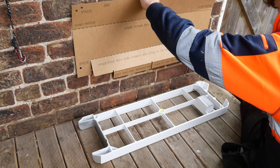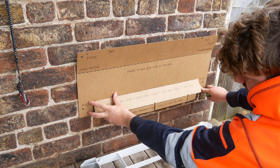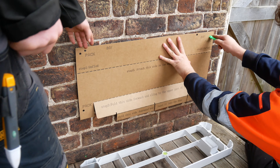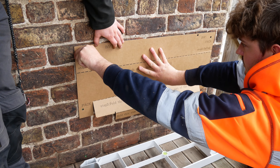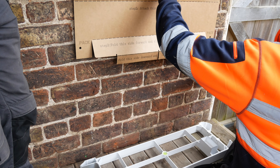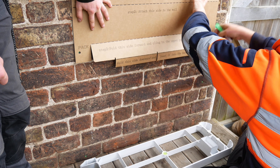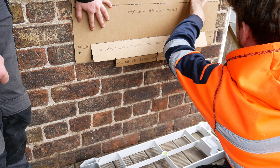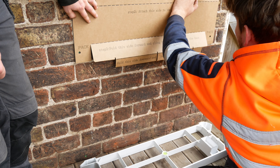This comes with a cardboard template so you can set your markings out based on the number of battery modules. You've also got your inverter that goes on top. So we've got a couple of battery modules — Nathan's going to hold the template while Matthew marks it out. Then we use the outer holes to put the battery module fixings in. Above that we've got the inverter itself, and those two holes are the inner ones marked INV. We've got the base on the floor set at the appropriate distance off the wall, and we can mark all these holes now.